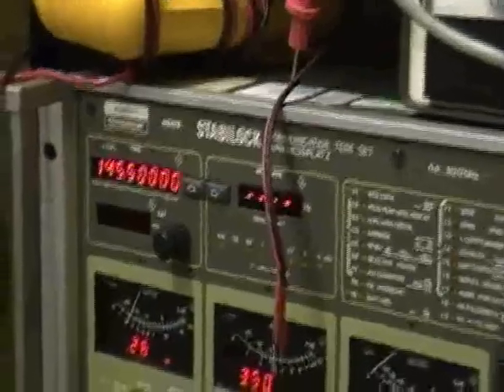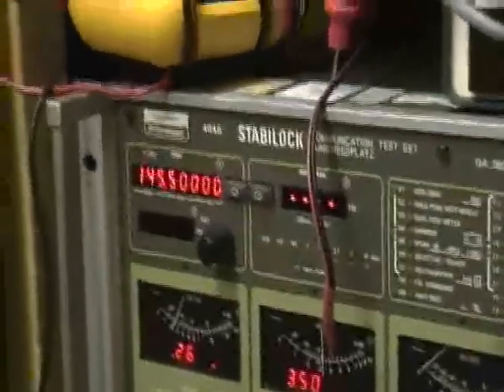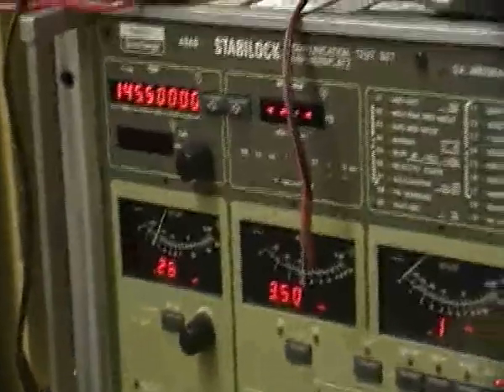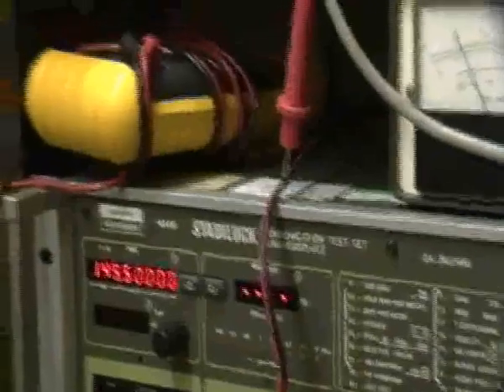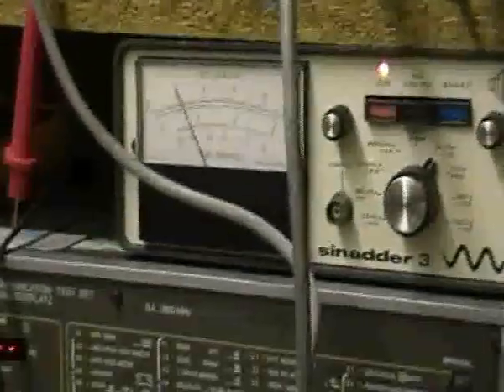As I say, just a quick follow-up. There's no signal meter on this thing, so you couldn't follow a signal meter to tune it up anyway — you'd have to use a sound meter or use the SINAD method to see how sensitive it was and how well it was receiving. There's just no signal meter there to follow. A classic example of why you need to ignore signal meters and just go for the signal-to-noise or SINAD method of checking receiver sensitivity. Thanks for watching.